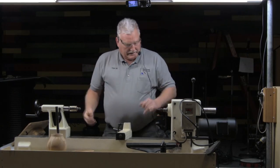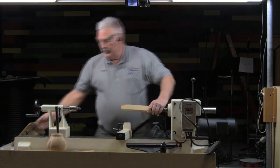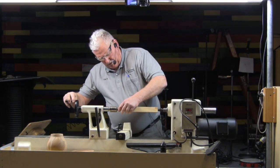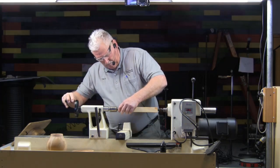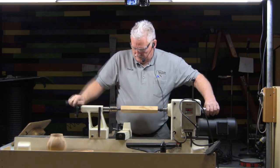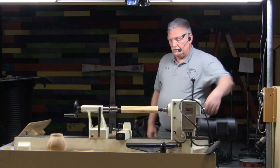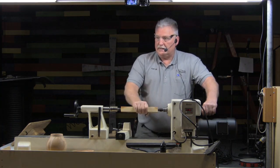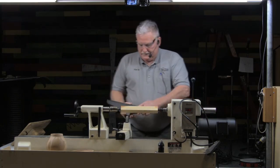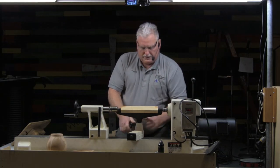When you start getting catches with this — I don't have any grooves or anything cut, just starting out — I've got a little center made. We get that in there. Now, when I turn this on I can still turn this by hand — that should be tight enough for us to round this off. Rest a little bit below center.